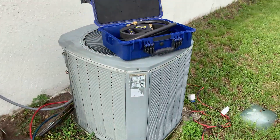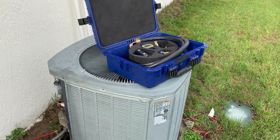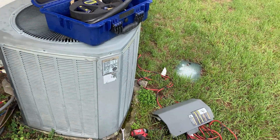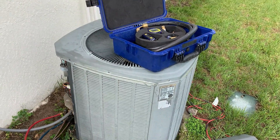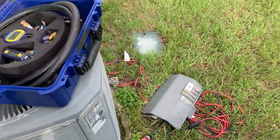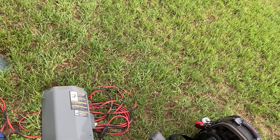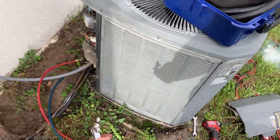I also have my case on top of the unit raising head pressure. That helps create a pressure differential to get gas out. In this case, we block the condenser a little bit if it's convenient. An optional but not necessary step two is you can take a pinch-off tool and crank it down on the liquid line.